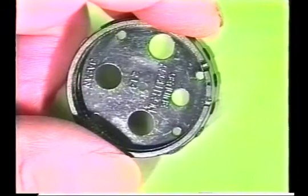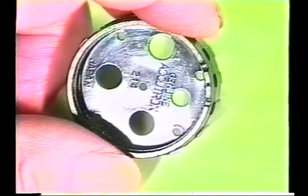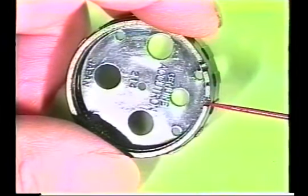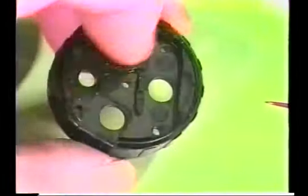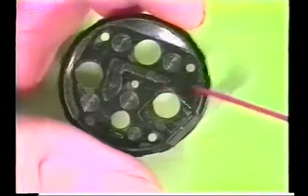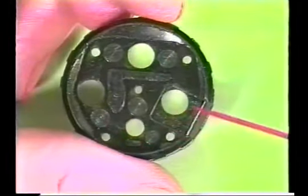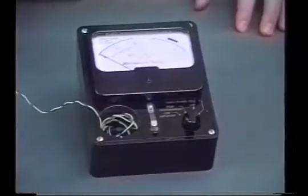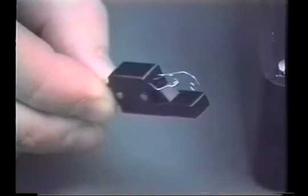Use a special plastic movement holder with locating pin and notches cut to accommodate the working stem. The other side of the movement holder is cut for use in removing the coil assembly from the movement, and a notch where a connecting plug from the Accutron meter plugs in. An Accutron meter is a must when working with Accutrons, and when plugged into the movement holder, the wire contacts provide current to the movement.